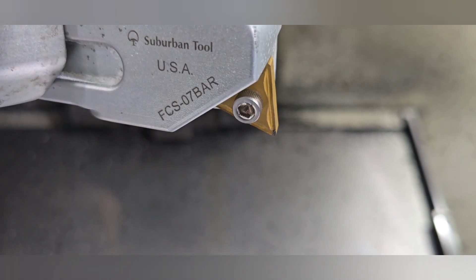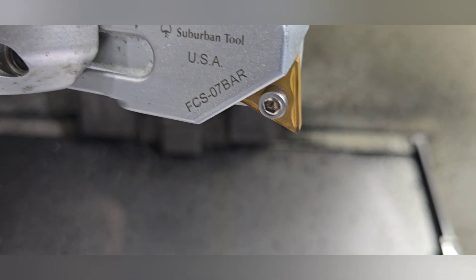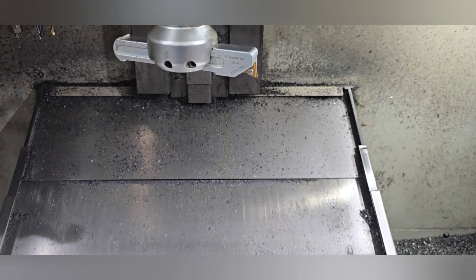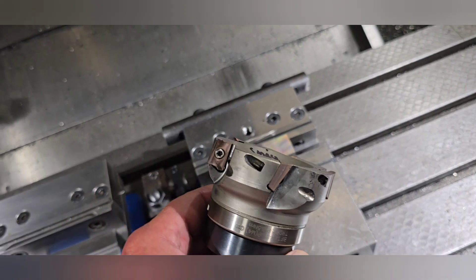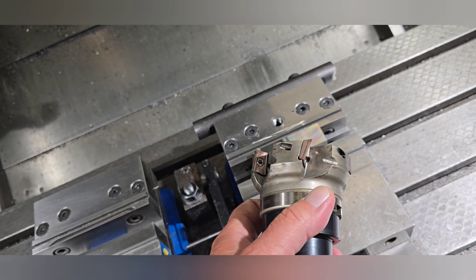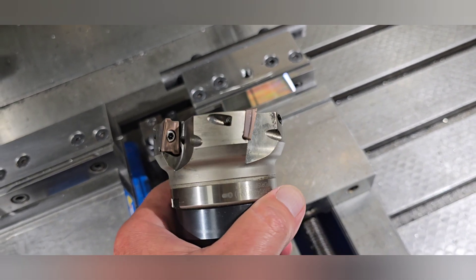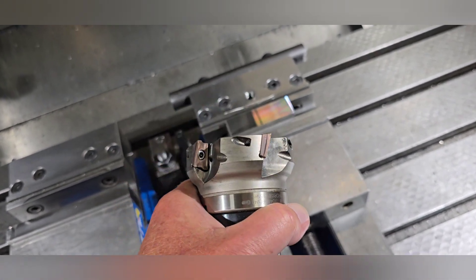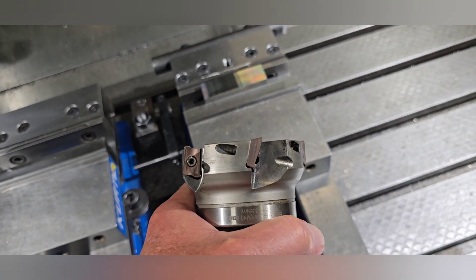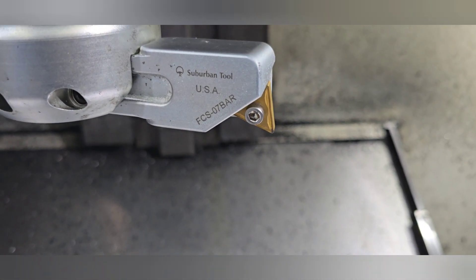There are a number of reasons, starting with cost. The insert is at most about six dollars, and at the least you can get these for about three dollars online — so you have six tips for three dollars. On a face mill like this three inch one, you have five inserts and they're approximately 13 or 14 dollars apiece. They don't like to take light cuts or you wear them out fast, so to load this cutter up it's about 66 dollars, compared to three to six dollars for the fly cutter.